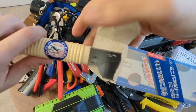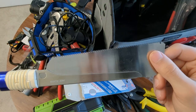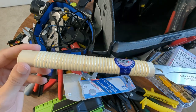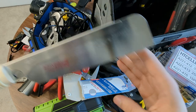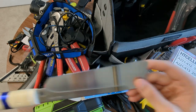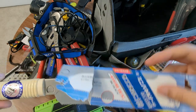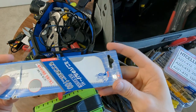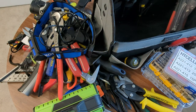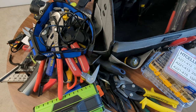I would say this is probably my number one used cutting tool. I have two Japanese wood saws and if you've never used a Japanese wood saw before, they are amazing. They're pull saws - they cut on a pull action. Very smooth. You can get fine tooth or more aggressive teeth. Anytime I have small cutting to do, I don't even bother with electric cutting. I usually hand saw for most things when I can get away with it. Can't go wrong with Japanese wood saws. You can actually get Vaughn brand Japanese wood saws at Home Depot or Lowe's, and they have replaceable blades.